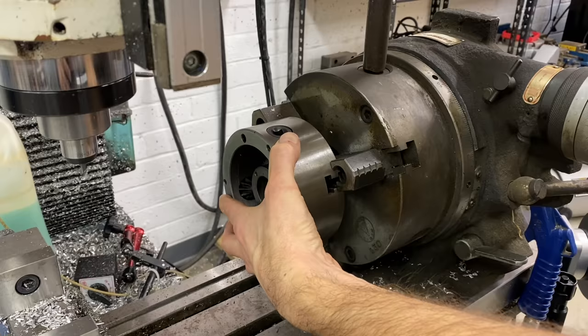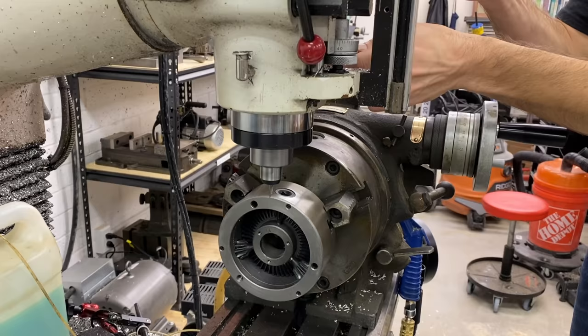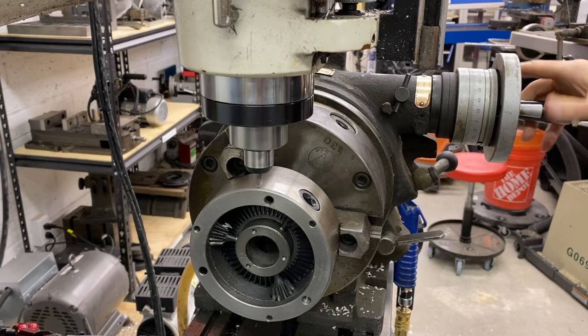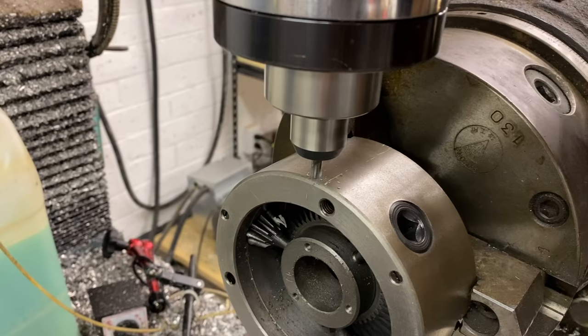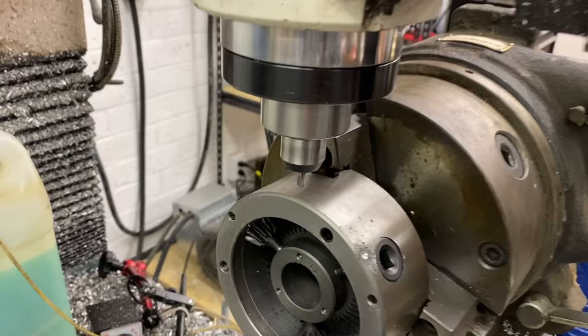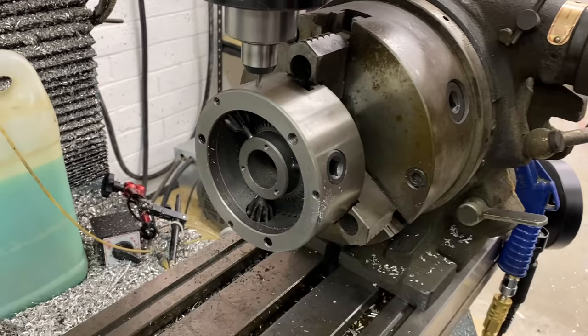Let's go around and double-check our angles. Hole number one at zero degrees — that's fine, not too close to that threaded hole. The others at 90, 180, and 270 degrees are all clear. I already know what size I want — a 5/16 spot drill. I'll go basically to the diameter of that spot drill, mark our Z so I get the same chamfer on all the holes. On most machines you'd do one hole at a time and change tools, but on this machine with a manual tool changer it's easier to do all operations with one tool before moving to the next. Holes are done, now we tap those.